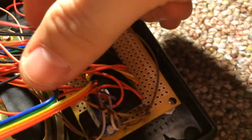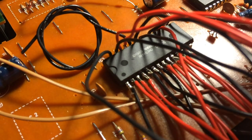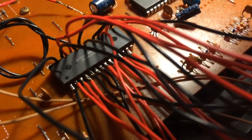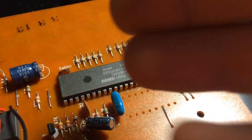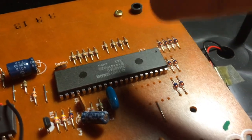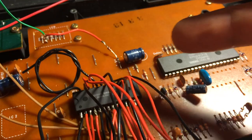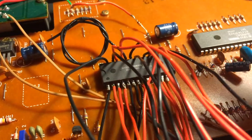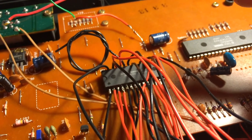These are all the wires for the various matrix connections, and pretty much what they're doing is connecting the RAM samples and mangling the bits of the various samples. I looked at the pinouts for these on a scope and a meter, and I realized that this one controls the screen and the buttons. This other chip is just the RAM — it stores all the samples for all the various sounds. On the other side of the board there is another chip, and that's the main CPU. That's a little surface mount chip. I could mess with that, but didn't really want to.